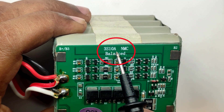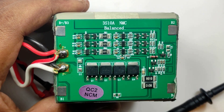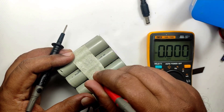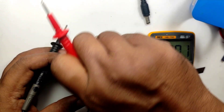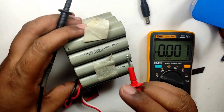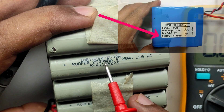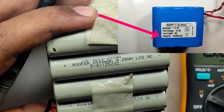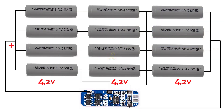At most, the battery can deliver 10A, and if you are drawing more than 10A then the BMS will disconnect the output. Each battery is 2500mAh and 4 batteries are in parallel, so maximum is 10A — but on the wrapper it is written as 10400mAh, which is wrong. This is the complete wiring diagram of the battery pack.